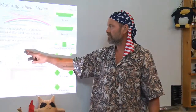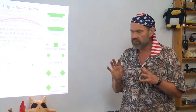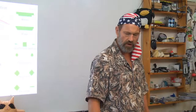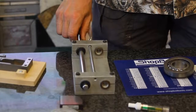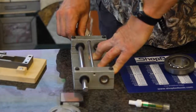What I like to do is take the covers off and look inside the machine. And I look for keys of how, for example, the modular bearing rails are attached to the structure. I want to go visit the factory where they make the machines, and as I'm walking through, I'm looking at subtle clues for how they align their bearing rails. When the carriage is on the structure without anything else attached, just casual conversation, you're walking through and you want to make sure, yeah, that feels real nice. Because once the machine is all bolted together, and there are deformations in it, if it's deforming too much, it won't move so easy. The actuator will force it to move, so it looks like it's going really good, but the loads are higher.